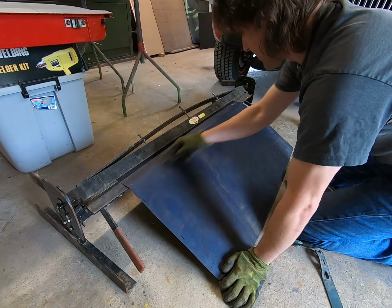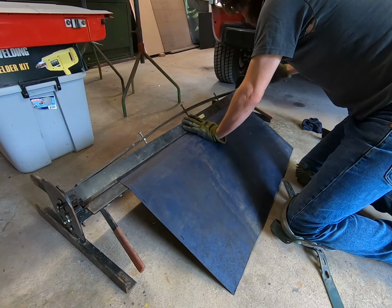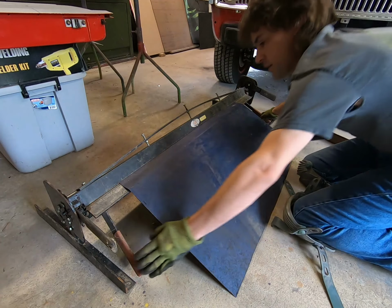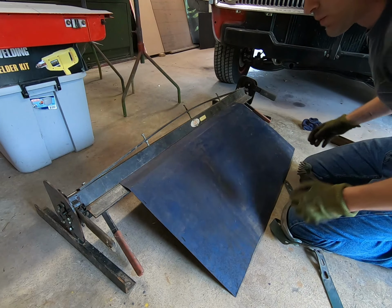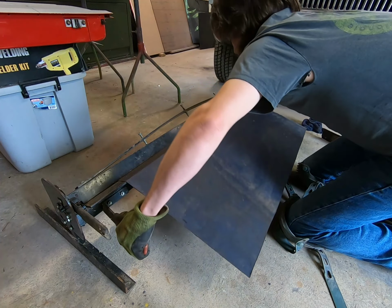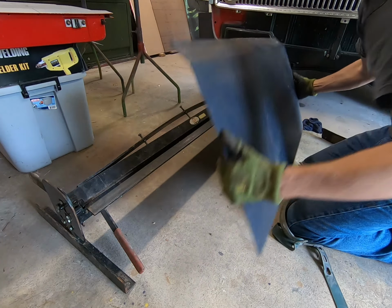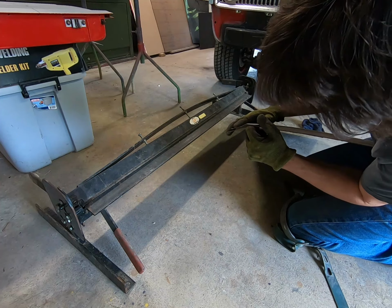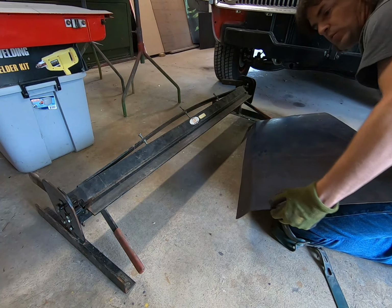And I'm using the heavy mark that we bent, and laying it right against this on both ends. Make sure it stays that way. So that's good. And there's less material, so your bend on it is gonna be more extreme, okay? So be easy on it, although we do need to go fairly flat with it. Like so. If you're not sure, back off and see what you just did. So, looks like it's doing something. The paint on it's kind of messing with you visually, but it'll come off eventually. So it still needs a little bit more of that radius on it too.